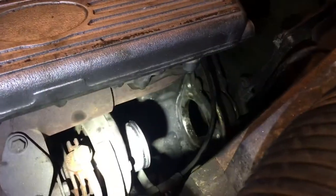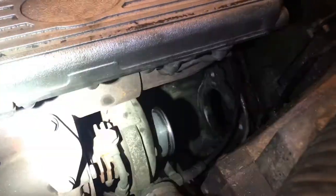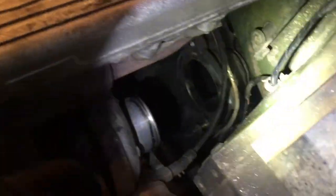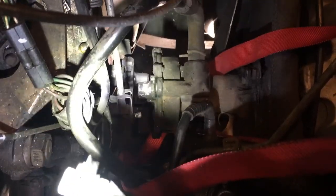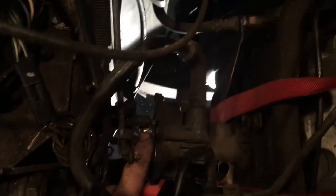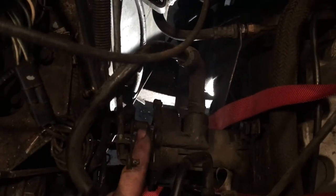Now that we've got the mounts, it's never going to be quite as easy to get the engine back in, because the bolts coming through mean the engine has to be lifted out enough for those bolts to clear and for the whole engine to come forward. Over here I can tell we've got the clearance to do that. However, now that the engine is exactly where we want it, I can see that if I try to lift it, it's going to hit on the fuel linkage. So I'm going to cut off that last little quarter inch right there — when this part lifts it'll hit on this part — just make a slice right there and then nothing will impede this from coming in and out again.